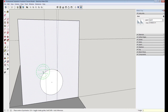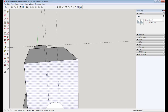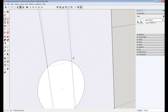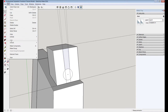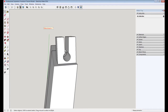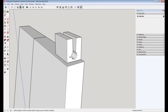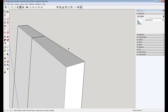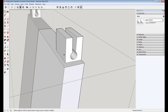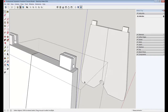I'll trace over those guidelines looking for the red intersection X's, then go to Edit and delete the guides, delete the section of the arc, and shove this little spot out — that's what we want our wedge tenons to look like. It only happened on one leg quadrant because we built that little tenon lug outside of the component, so I'll triple-click, go Ctrl+C, delete it, go inside the component group, and go Edit > Paste in Place. That nicely puts our tenon on top of the component. I'll go in and delete the surface inside and retrace this line to build that surface back up — now each leg quadrant has a tenon.